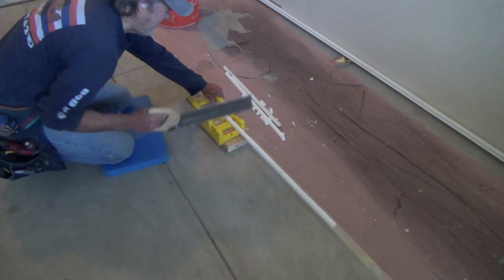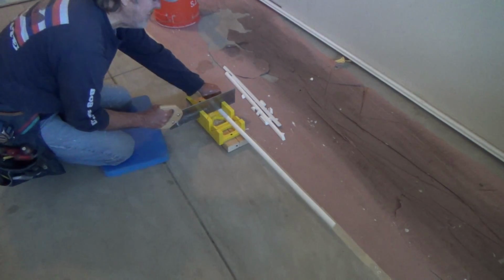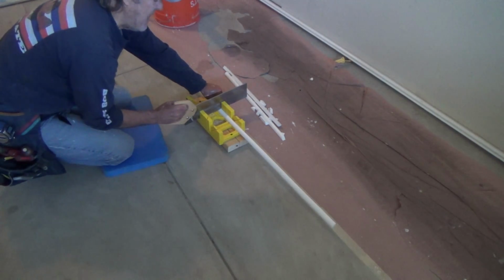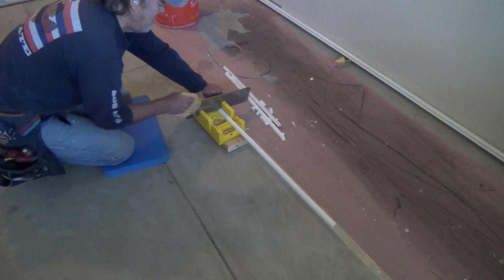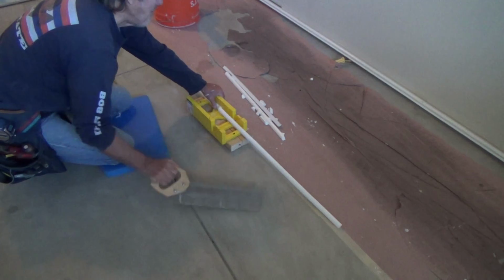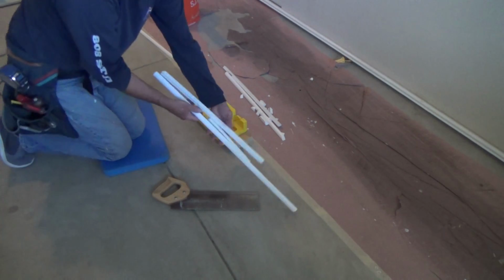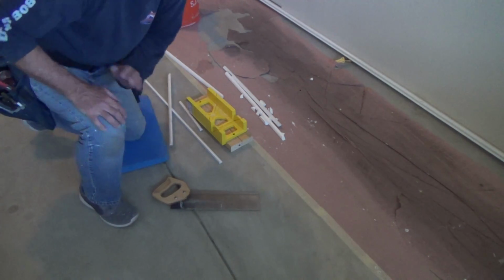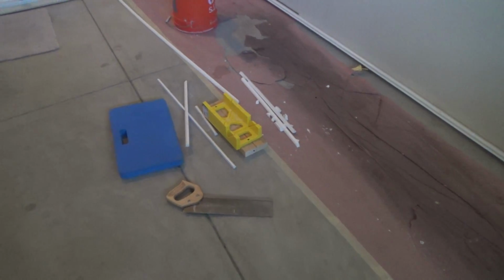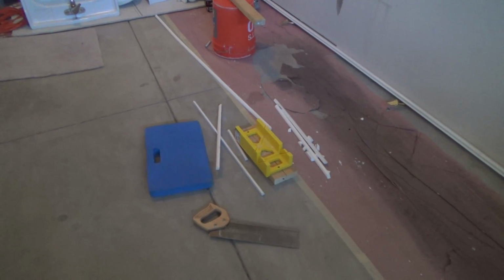I'm going to cut that one off. See, I can just hold everything right here. I can get my thumb within an inch of that. Hang on to this. Light strokes. Don't try to do it hard. Then it will bind up. Okay? There. Here's our 3 pieces. Now I can go in there, we can mark these, and then I'll have to come back here and I'll show you what I do after that. See, back and forth we go. Hey, this is just what it takes to get your quarter round installed.